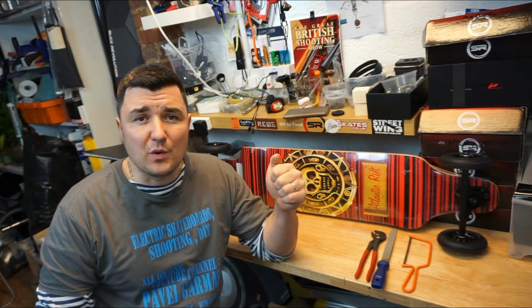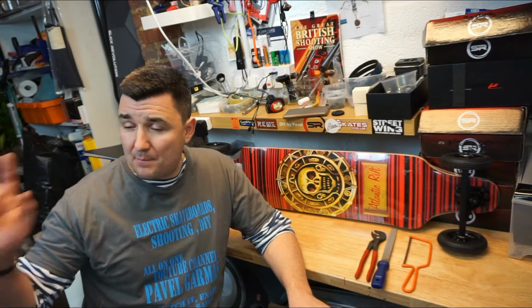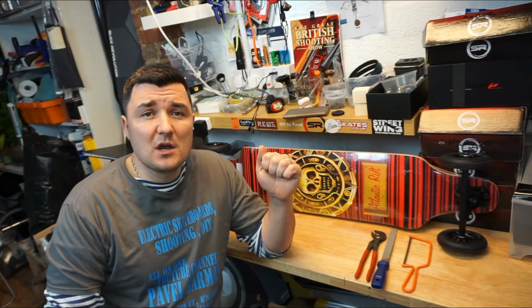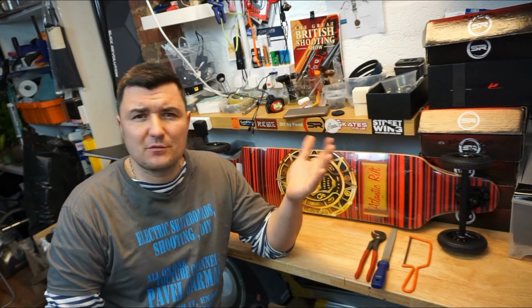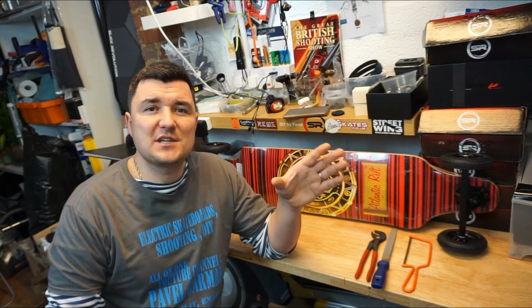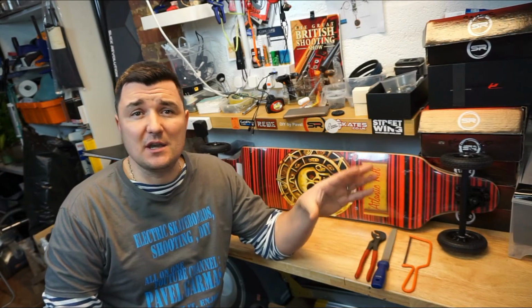One more thing is the anti-spark or the spark-free switch. Luckily the Flipsky 6.6 Plus, the one I've ordered for this build, does have one already inbuilt, which is great. For my previous DIY board, I have used a 65 amp rated anti-spark switch. This is something that protects your ESC if for whatever reason you would have a spike in the amperage of the batteries, goes crazy, it won't burn it out, in simple terms. At the same time, this is something that you press and it activates your board, so it sends the power from the battery pack to your ESC and to your motors.